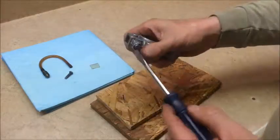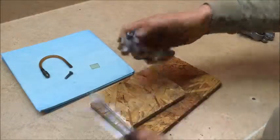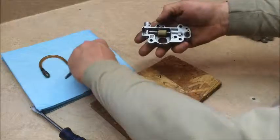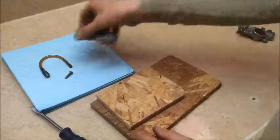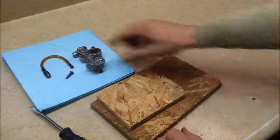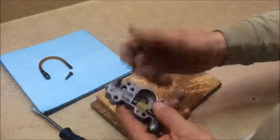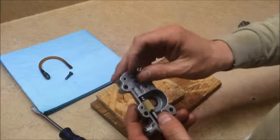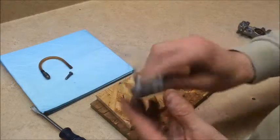And that just holds that in. Debris door — this is going to save you a lot of times from blowing out the door on an old one. This will put pressure back on the tank. If your tank vent on the oil tank is not working, it's going to put pressure right on that door and blow it out.